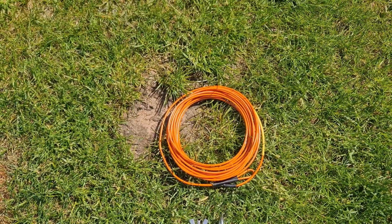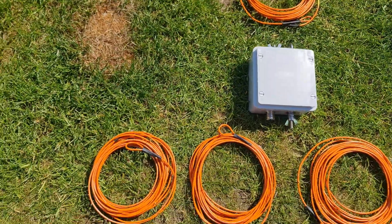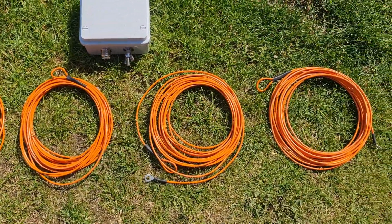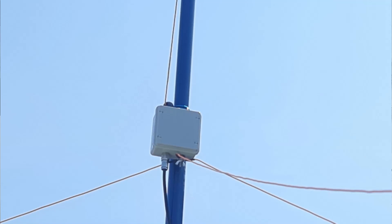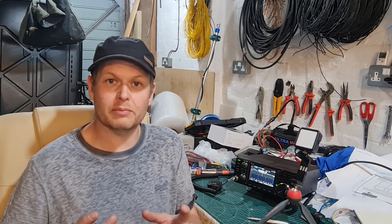I'm going to talk about the matching unit in a bit more detail because that's the important part. We have a single radiating element — you can see I've marked it with yellow heat shrink — and four radials. In my test today I've used three, and two in another test, but the first time I used all four. The match doesn't seem to be affected once you get it correct, because it's a tuned radial. I'm using elevated radials so I can carry less wire.